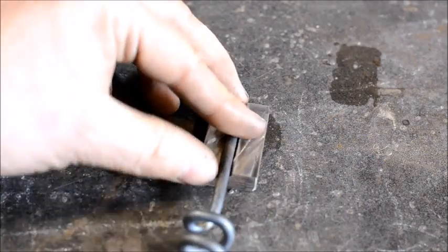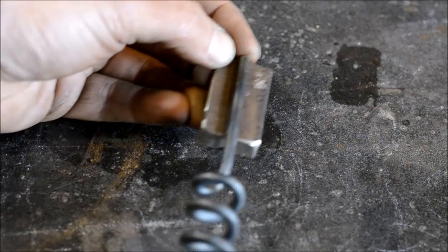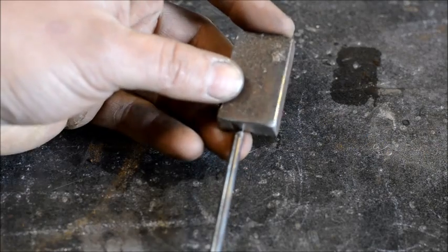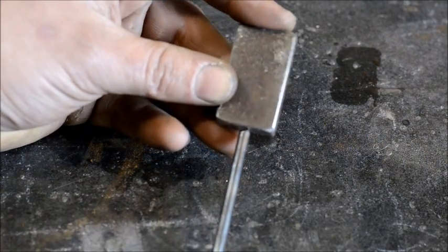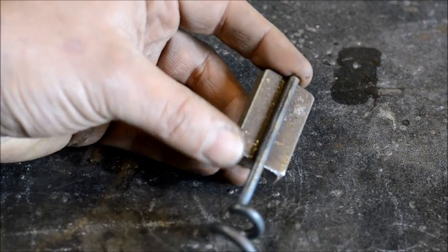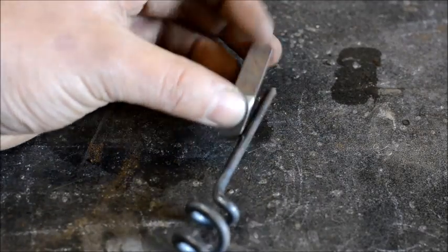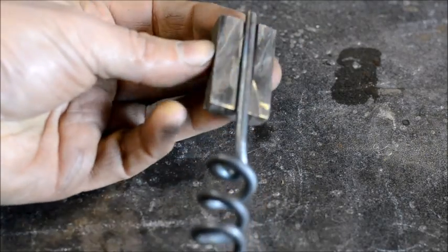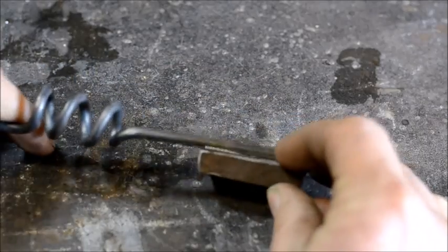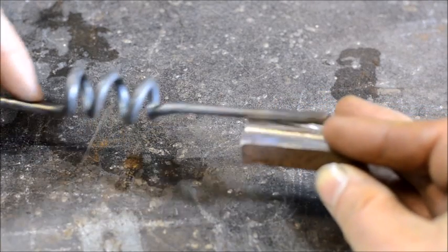You may be asking yourself, why don't you just lay this on top of a piece of stock that is already three-eighths by one, and just weld it on top? Same reason as mentioned before — any piece that's just stuck on to another piece with weld, you're relying on maybe a sixteenth of an inch of penetration from the weld into the actual material. A lot of times it's less than that, and under the power hammer it just won't take it. If you did it on top, you're barely getting any penetration. Plus, it leaves the whole piece very unbalanced. When you put it in like this, it makes the whole piece balanced and in line — it keeps it more in line. If you just welded this right on top, it would feel more unbalanced. When it's down more into the core, it feels a lot better.